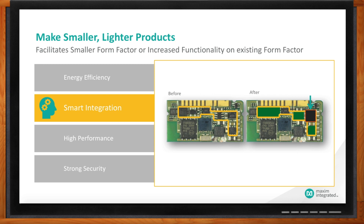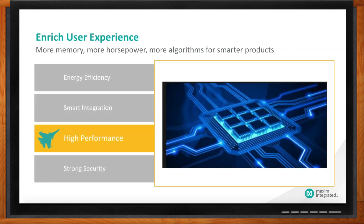Things like this have to be smart, and that requires horsepower. What kind of processing power are we really talking about? We've got pretty powerful processors in these things — they're Cortex-M4Fs, which means they have DSP capability and floating point capability. These processors can run more advanced algorithms and do it power-efficiently. A lot of algorithms — like taking raw heart rate data and figuring out your heart rate, or looking at blood oxygen level — need those DSP and floating point capabilities to do the job efficiently.